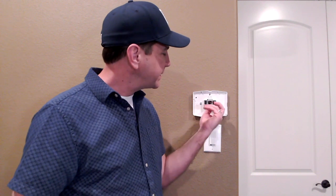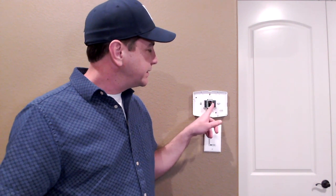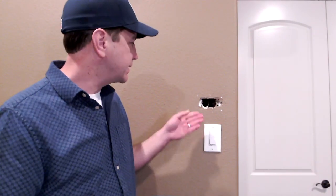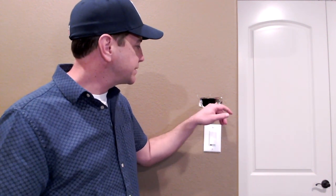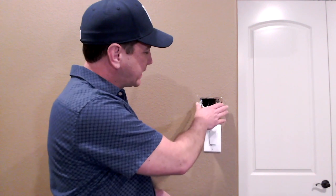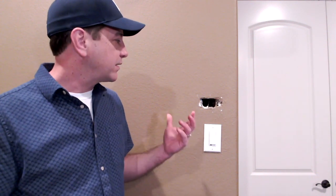While we've got this open, each of the wires is labeled inside the box, so I'm just going to do a one-to-one match connecting up the new thermostat. Before I go any further, I wanted to show you the opening I was talking about earlier. It looks like it's a single gang box used in the new construction, so it's possible I could get just the smaller steel wall plate on there. I'm going to try that first, see how it looks, and if it doesn't cover the whole space I'll go back and put the larger plate on.